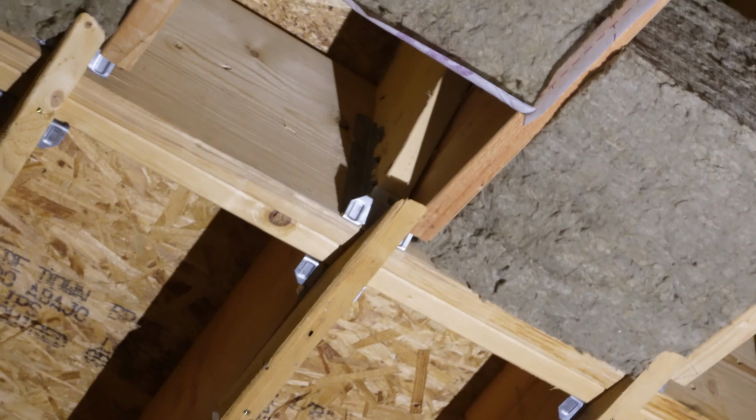and any extra we're gonna put in these little attic spaces, the 3 little attic spaces kind of between the dormers. And if we have any bats after that, they're gonna just get tossed up in the attic on the north and south sides, kind of the perimeter of the house where the most heat is gonna be lost. We did quite well on the R15 estimate. Also, there is literally just one bag and one single bat in this top bag left over.